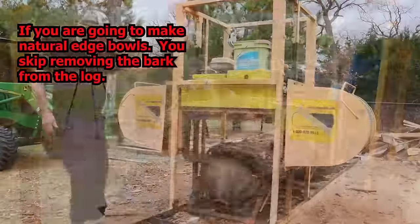So I'm going to say that I'm going to leave that thing right there and cut a 6-inch bowl blank on this side. If I just cut right along the pith line, that'll give me right at a 5¾-inch or 6-inch bowl blank. Below that, I'm going to say I'm going to get a 3-inch bowl blank, which is going to be right there. And then that leaves me with about a 4-inch bowl blank. Time I flatten this thing out, cut the bottom off of it and get it squared up, something like that says 4.5-inch. So on the bottom I can get a 3-inch slab and a 4.5-inch slab. The top I can get a 6-inch slab. So we're gonna get 3 bowl blank slabs out of this log. The middle we will use for other purposes.